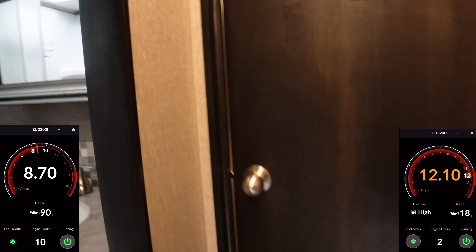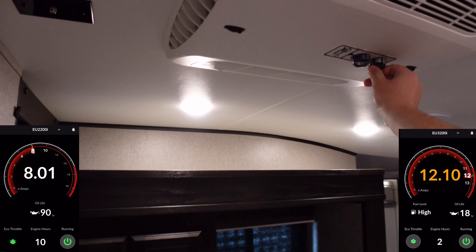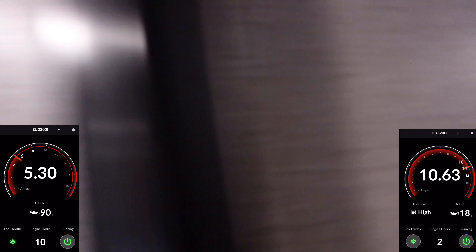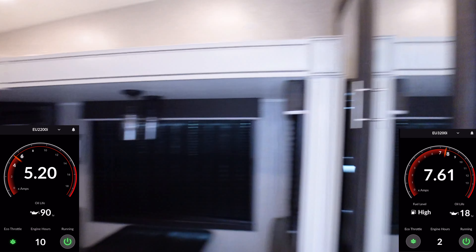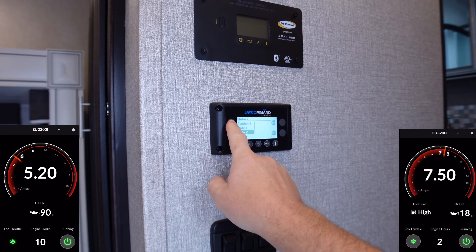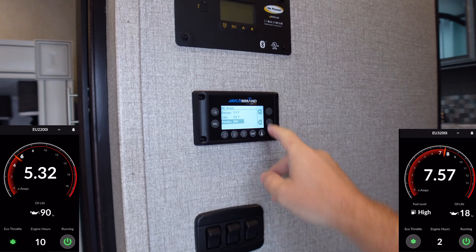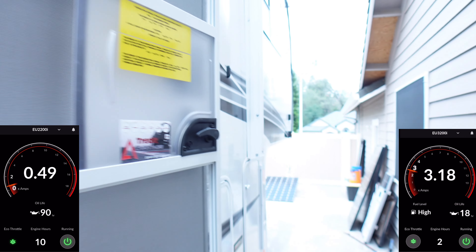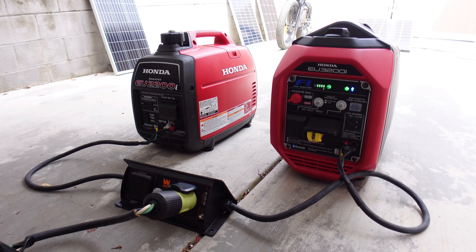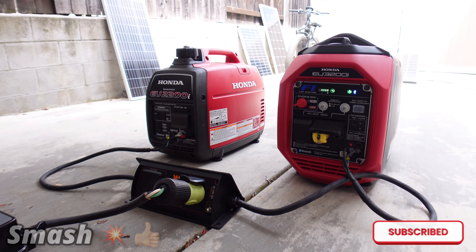So far these work just fine together. We're going to turn these off — turn off the front AC, then the main AC. Now you can see the amp spread is back down to only about two amps, so as the load builds the amp spread obviously builds up as well. We're pretty much close to max on both generators — that's 21.7 amps for the new generator and 15 amps for the old one. Overall, what do you guys think? Leave a comment down below and be sure to smash the like button and check out this other video right here.